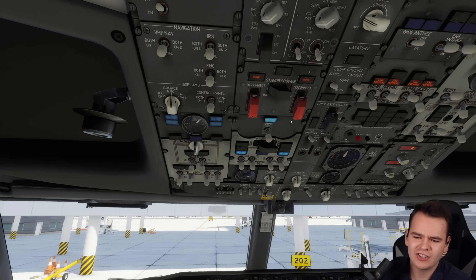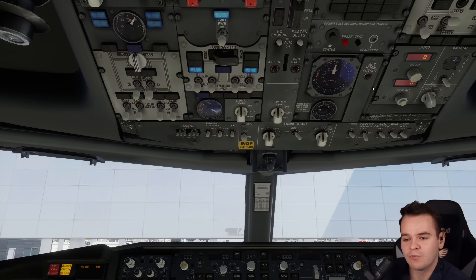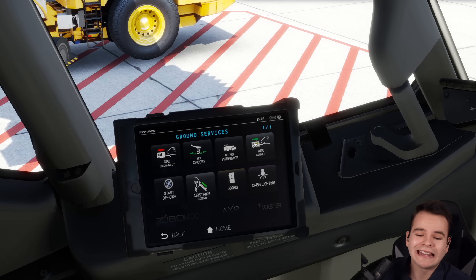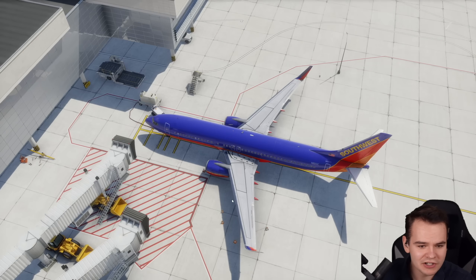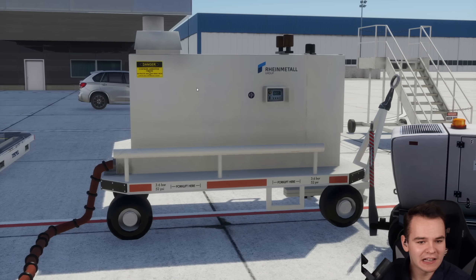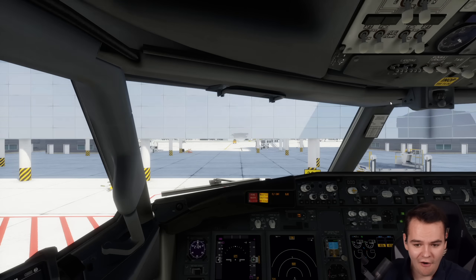The GPU is just not capable enough of cooling the airplane down — we've got a very hot cabin. But now a major problem is that the engines definitely won't turn on; I can try to start them but it just won't work — that is absolutely dead. Something we do need now is an ASU, the air start unit. Let's connect it right here — it looks like this. This provides now actual bleed air, and this will finally allow us to turn on those engines.